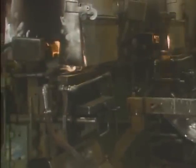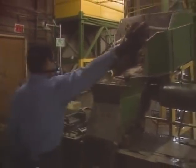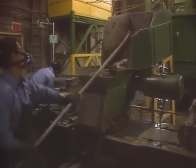Today, for example, furnaces melt heavy lead bars. Then, the lead is cast into grids or plates that will serve as electrodes. Here, the plates are coated with a mud paste, a mixture of lead oxide, acid, and water. Filler is added to the batch of mud that goes on the negative plates. Then the plates are assembled, alternating positive and negative with a fiberglass mat in between each pair.